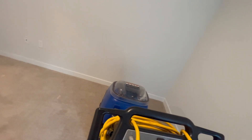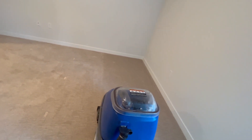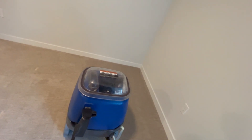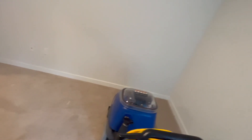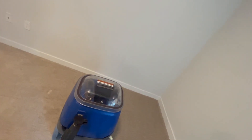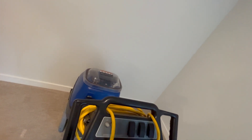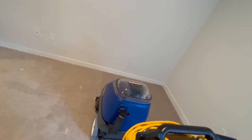It's doing a fantastic job. With steam cleaning, unlike VLM — where I spray it or use my shower feed and use a pad and an Iron Man pad to absorb the solution out — by the time you're done, you're looking pretty much at the finished product. It looks kind of bright and shiny and you're looking at the results. With steam cleaning, you're going to see the greatest results the next day.